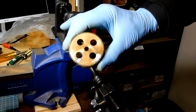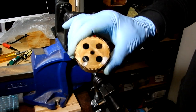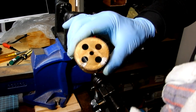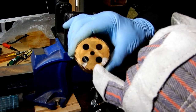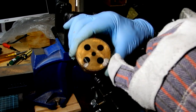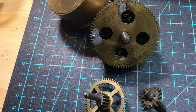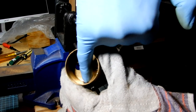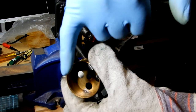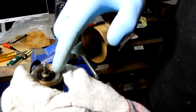And a top quality job soldering in there — that is unbelievably bad. It's lost two teeth. I'd say a spring's broken at some time and he's made a rough sort of a tooth thing, hammered it in, slapped a big chunk of solder on it. Very classy job. And of course the solder's run inside here in a blob and it's catching on the side of the spring.